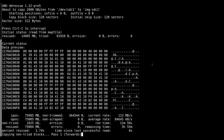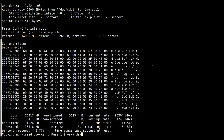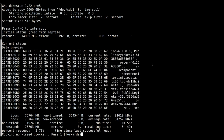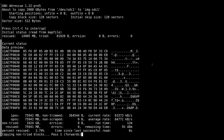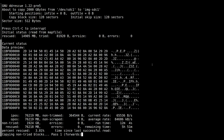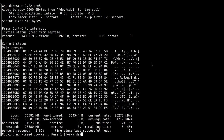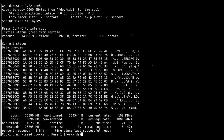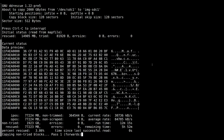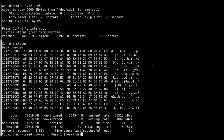We had to fix the controller by replacing the broken switch mode voltage regulator. That was a real shot in the dark, but thank God I did it. And even more thankfully, I had a close enough donor that I could take that from, because there is absolutely no way in heck I could otherwise work out what that controller chip was. I mean, I sort of knew roughly what it was. I knew it was going to be some sort of buck controller, but picking out the right one, that would have been a nightmare.